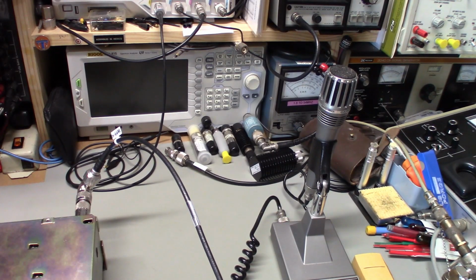Went too far. There's 3.86 megahertz. 120 watts. 7.36, 120 watts. 10.36, about 115. 14.36, 110. 18.36, 100. 21.36, 100. 24.86, 100. 28.36, just a hair under 100. 28.86, a little bit under 100. 29.36, down to about 90 watts, which isn't surprising, and 29.86.